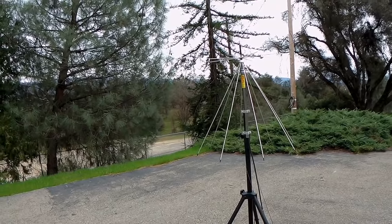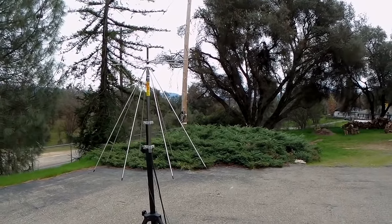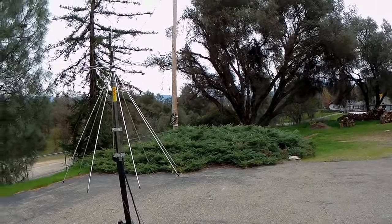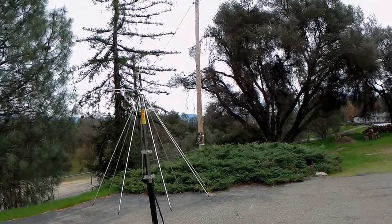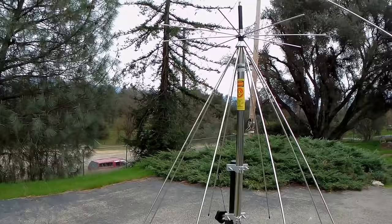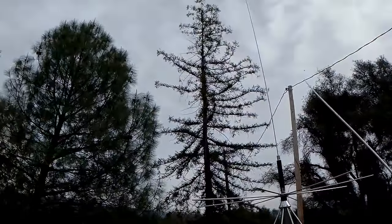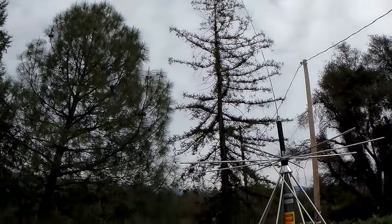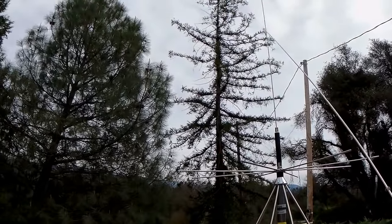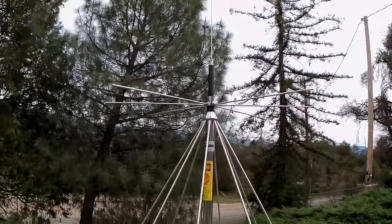I want to test out this disc cone antenna. I know it works at VHF 150 megahertz, I know it works at 450 megahertz, and I know it does okay on 800. But I want to do low band VHF - that's like six meters, 50 megahertz - and actually go a little lower in frequency, around the 30s and 40s. These components here are tuned to VHF and higher frequencies. What's tuned to the low band VHF is this component here, which is actually a coil. This coil will make this whip electrically longer, not physically.